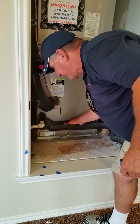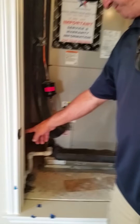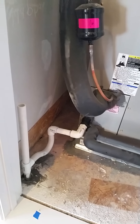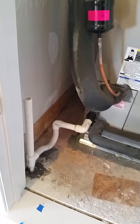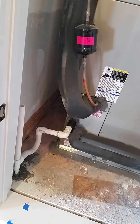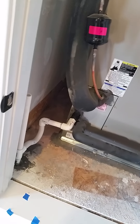Both filters are 20 by 20 and have to be changed every 30 days. For the AC condensate clean out, you pour one cup of bleach then one cup of water down there — at least once a year, some say twice. Always do it at the end of the AC season especially, because there's a P-trap and the water will sit in there causing mildew and mold. If it gets clogged, you'll need someone to come unclog it.